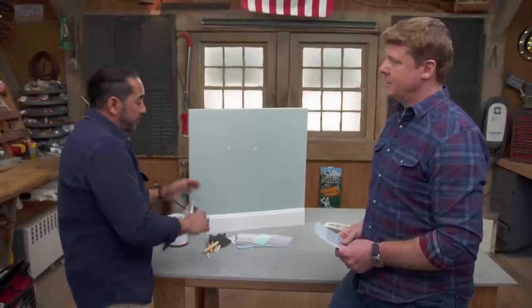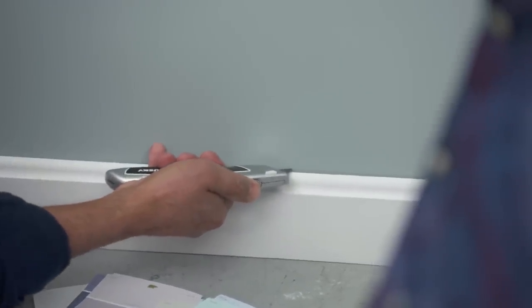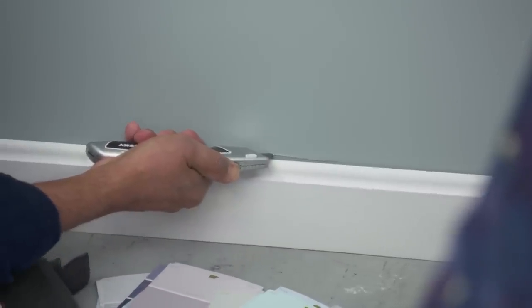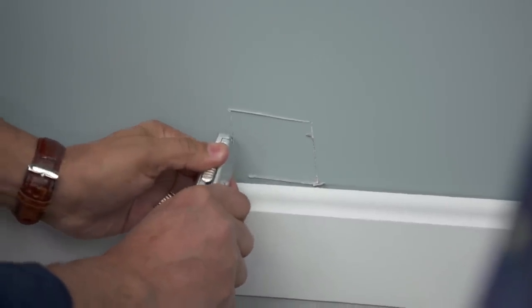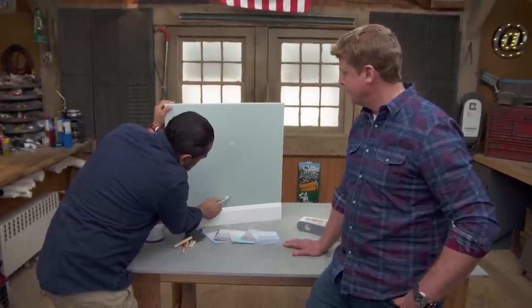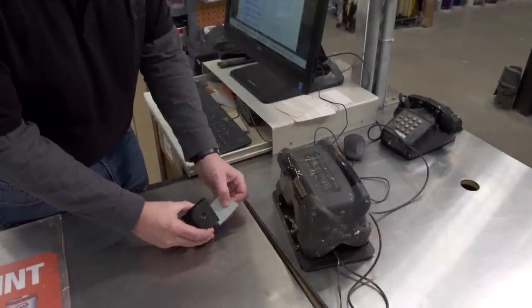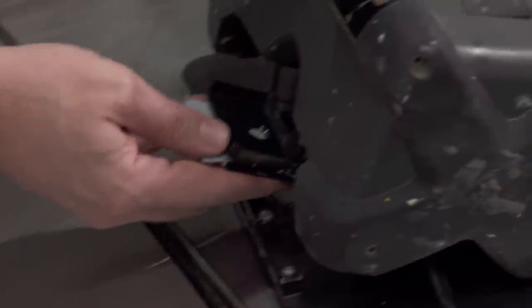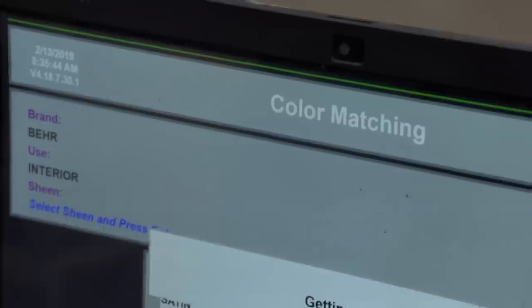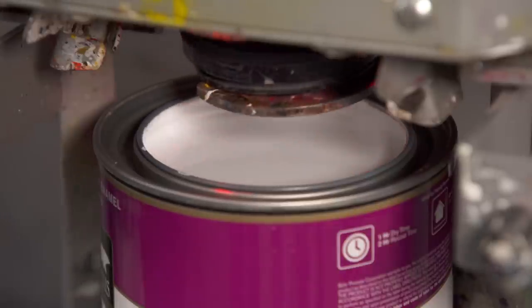In that case, since we can't get any luck getting a closer color, I will use my utility knife and choose a place on the wall behind a piece of furniture and cut a little piece. There's a little layer of paper on the drywall — we try to take just the paper off. I'll bring it to the paint store or home center, where they have electronic readers. It will read the color and then we can have a customized paint to match it. The color reader tells the machine which pigments and how much of them to put into the raw paint.